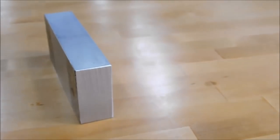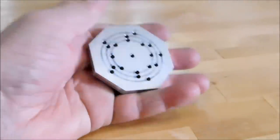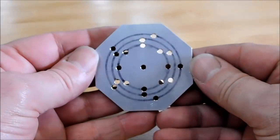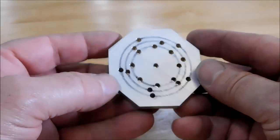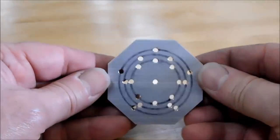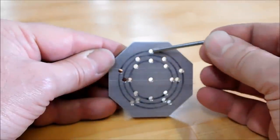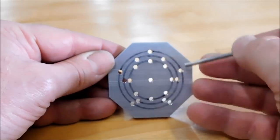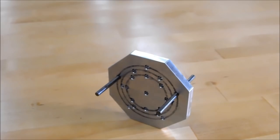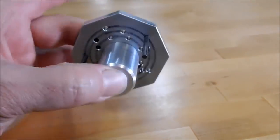On to the budget material. If you don't feel like spending a lot of money and you have a stock rack, make yourself an index plate. This little guy here looks like Swiss cheese, but I know what I'm looking at. It has three rings on it — you can see the three rings by the Sharpie marker that's wearing off. It's also an eight-sided object. The outer ring will give you five or ten position options depending on what side is up. You put pins through the part, get your crazy glue or double stick tape out, and now you have a billion indexing options for your part.